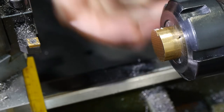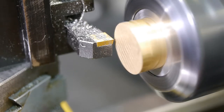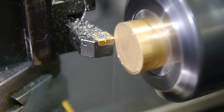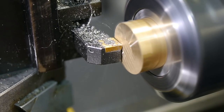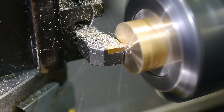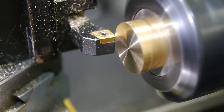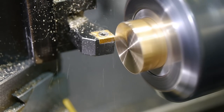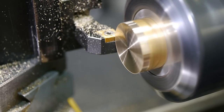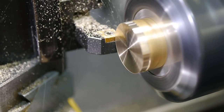Finally, I made a custom washer to give the tool post a bit of extra stability and a pleasing appearance. Brass is a little softer than steel, which allows it to yield slightly and give a really solid contact all round. It should also have lower friction, reducing the chances that turning force while tightening the nut will cause the tool post to rotate.